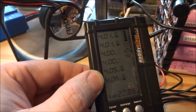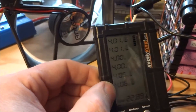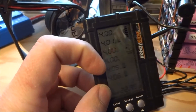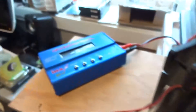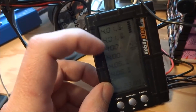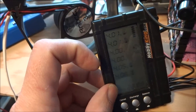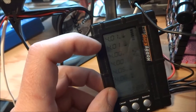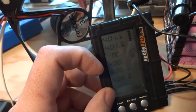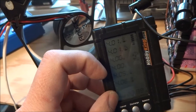In order to expedite this and not put too much stress on this balancer, what I've done in the past is either discharge these two using the IMAX or charge these four also using the IMAX. I prefer to charge the low cells because my goal is to get them up to 4.13V, so that's what I'm going to do.